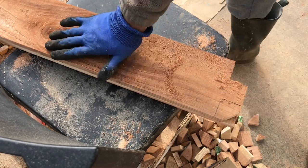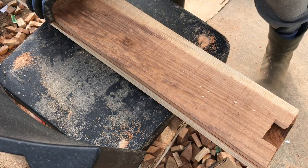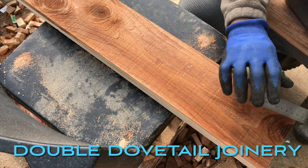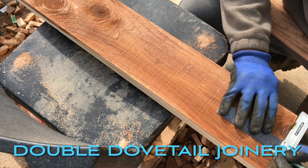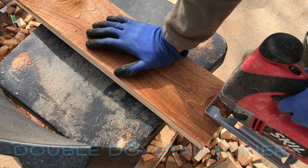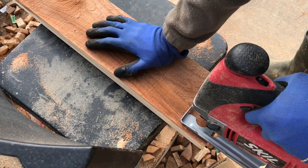To save on cost, because cedar or any other natural wood can be expensive, I decided on using cedar fence panels. Being aware that these five raised garden beds will become a feature on their own on this side of the garden, I did not want the joinery to be plain and without depth and texture. So I decided on doing what's called a double dovetail joinery — not only for the interesting lines they form once we join the corners, but also because this gives it a New England traditional colonial look. It will make it very appropriate once the cedar panels have weathered into a gray color. What's more, this style of joinery will eliminate the need for corner posts.